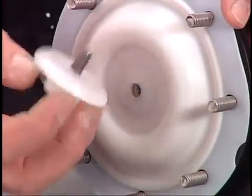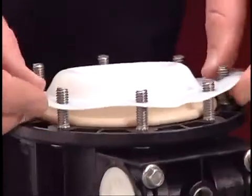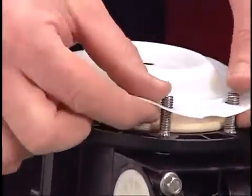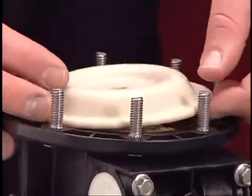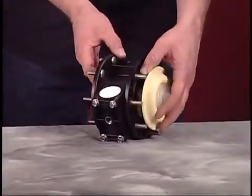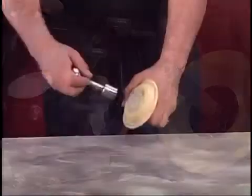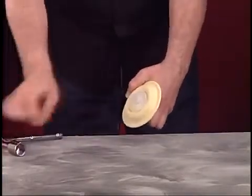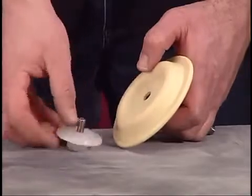Models with Teflon diaphragms include a backer diaphragm. Carefully push the connecting rod through the pump center body. Use a 7/8 inch wrench or socket to remove the remaining diaphragm nut, diaphragm, and washer from the connecting rod.